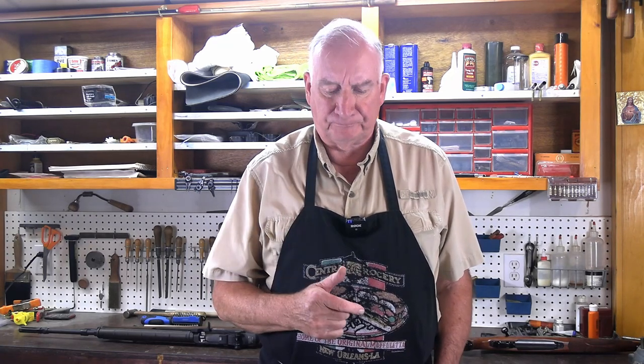The epoxy, properly oriented in your understanding, is only to be the shim that's necessary to fill that void where tolerance has left a gap. That's all it is. It's just simply a shim. Now, epoxy has to have a particular thickness in order to stay there. When I say a thickness, I'm talking about the thickness of a piece of paper, maybe 1.5 thicknesses of a sheet of standard 20-pound paper that you put in your printer.